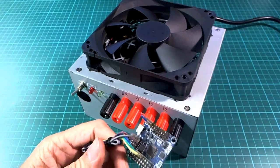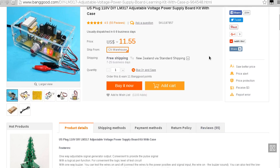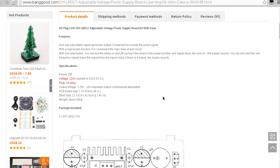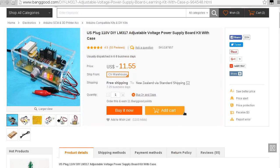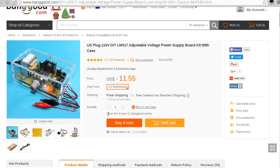So after a while I got a bit sick of that and I bought this little thing here on Banggood because it was so cheap. I've seen people using variable bench power supplies on YouTube and I thought that looked pretty neat, so I'd try a cheap version of what they were using. It kind of worked alright although it didn't actually go up to 12 volts like it says and the power output is very weak — only two watts.